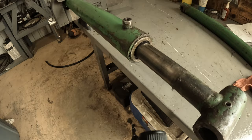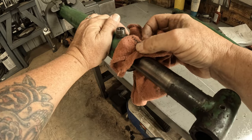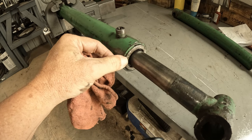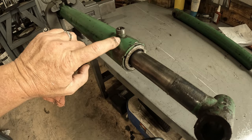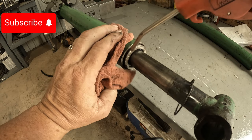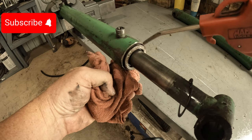Now down here, this is an older cylinder and somebody's been beating it like a redheaded stepchild - it's all pummeled up and has marks all in it, but it'll be okay. So we're going to get this snap ring off right here first. And then once we get that snap ring off, we're going to knock this gland in. Just slide that down. Now I'm going to take a little compressed air to get that blown out. Then we're going to take a punch and a little hammer and knock this in.